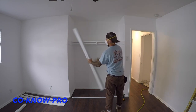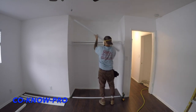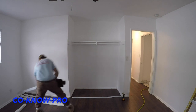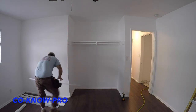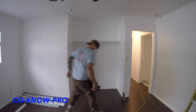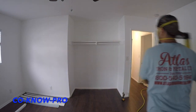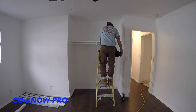That's my top track. When I double-check everything and make sure it's good, I have all my cuts pre-cut. What we're using for the wood is pre-primed pine — the sides are going to be a one-by-three, and the top is going to be a one-by-four.